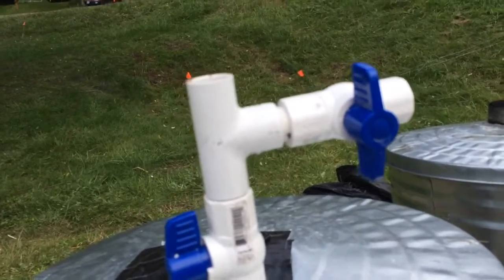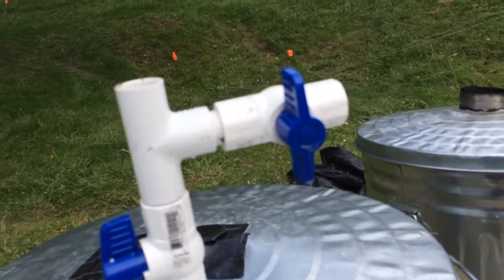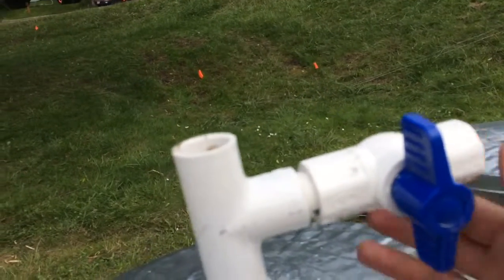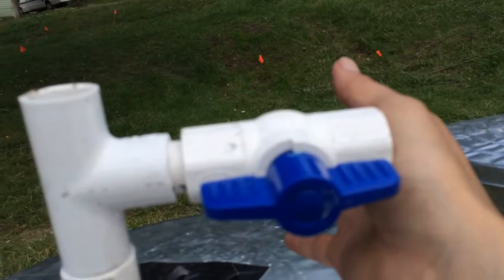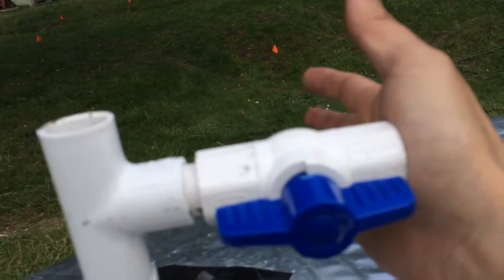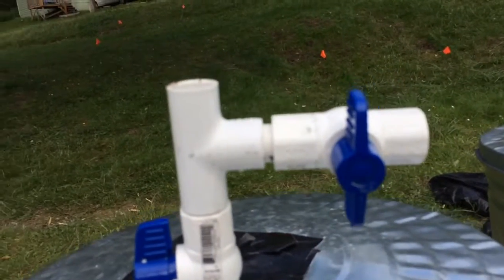When starting up, my engine has a fuel cutoff valve. I would initially run the engine off of gasoline, then shut off the gasoline and the engine will run for about 30 seconds before it runs out. At that point I would use this valve here — open it up full — and then put my hand over it to partially cover it. I had to nurse it through the transition between running on gasoline and running on wood gas, giving it just enough oxygen to keep it going. At some point it would get enough wood gas to run smoothly, then I would completely cover it up and lock the valve shut, because it basically didn't need any extra oxygen to combust.